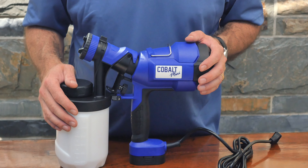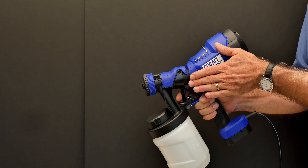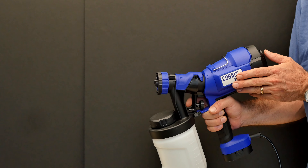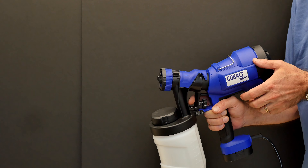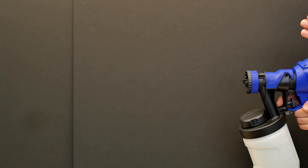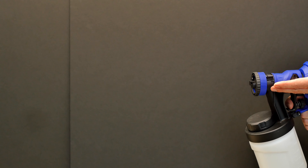If you're more of an up-and-down sprayer rather than left-and-right, you can rotate it and that will rotate the fan to point in that direction. The air adjustment changes how wide or narrow you want your spray. There is also an adjustment for the amount of flow — a plus and minus — and as you rotate it up, more disinfectant comes out the end. It doesn't change the size of the droplets, just how fast you're applying it. Turn it down for smaller intricate areas, or dial it up to cover a lot of ground fast.